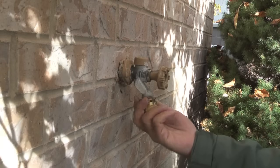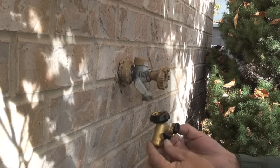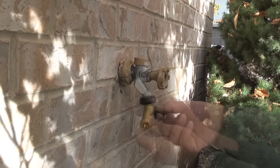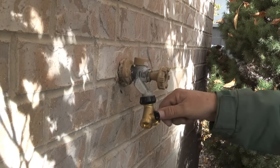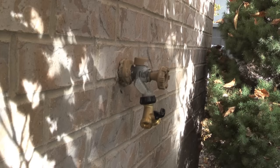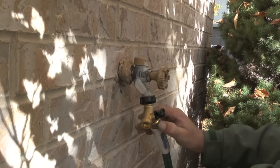To make a connection to feed a garden spot, a greenhouse, or even a lawn area, what I like to use is a hose Y. What you see here is a brass hose Y that threads right onto the tap. I like to use a hose Y because on one side I can feed the PVC pipe and on the other side I can attach a garden hose for intermittent watering. The hose Y has a small shutoff valve on each side, which allows me to control the water coming out of either side.